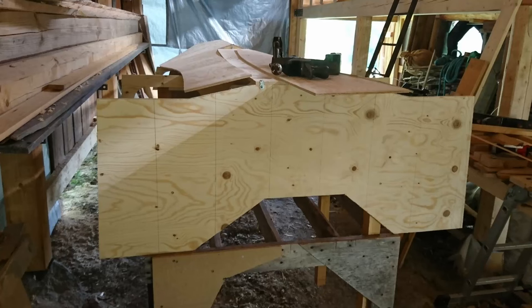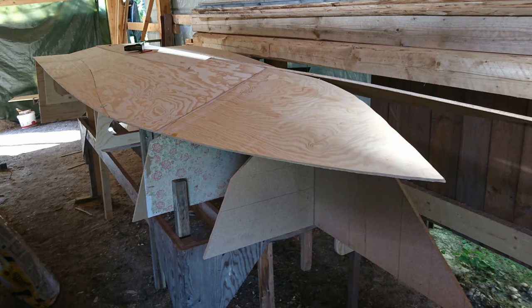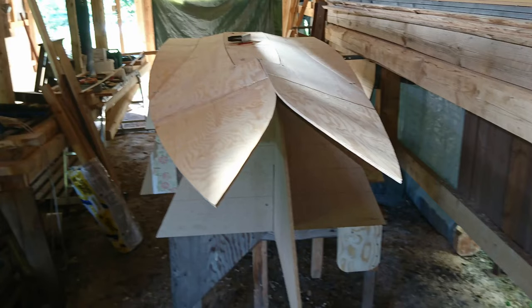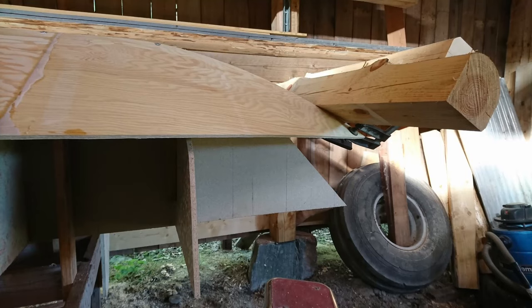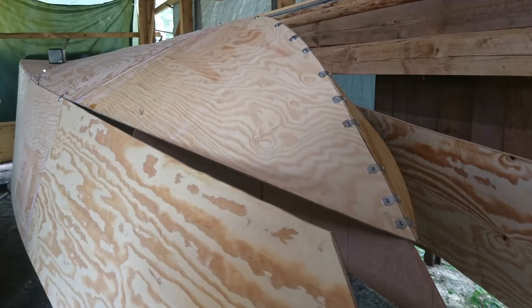I attached all profiles to a table — this makes it easier to work. Then I started attaching the hull pieces, working from the inside out so the innermost pieces were fastened first. I used small metal brackets and screws to hold the pieces together temporarily. The bow has a quite aggressive bend and I was actually afraid the plywood would break. I left some weights on it overnight to relax the strain in the material, and by using quite a lot of the metal brackets I got it bent all the way.